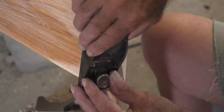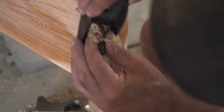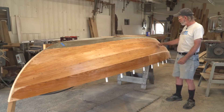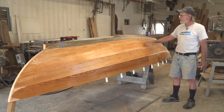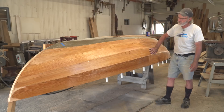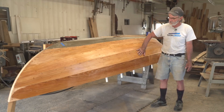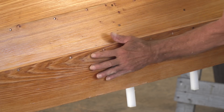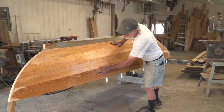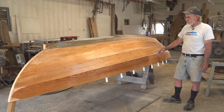We're back from Mystic Seaport with our Sport Dory and we've got it in the shop here upside down. You can see that it's been riveted all off — we finished the riveting that we didn't quite finish in Mystic. All the rivets are under the surface and what we've done is saturated the wood with a penetrating epoxy. This stuff is great because it makes it go right into the soft grain. I really like to use it on top of steeple grain because it saturates down under and helps hold it down — that's a vulnerable type of grain.